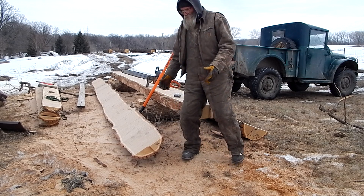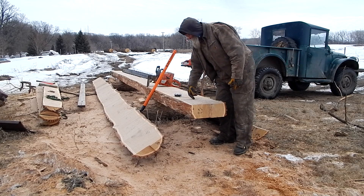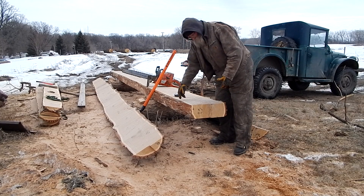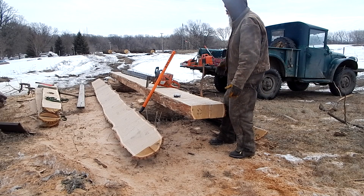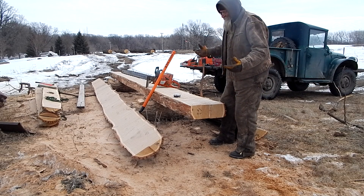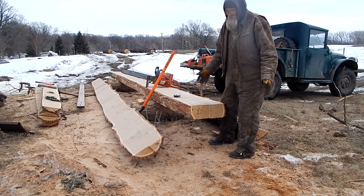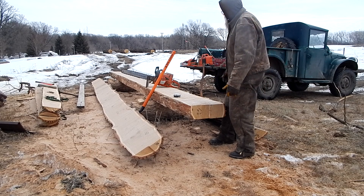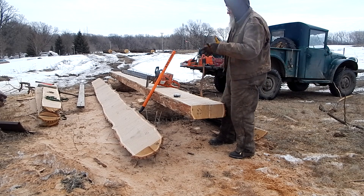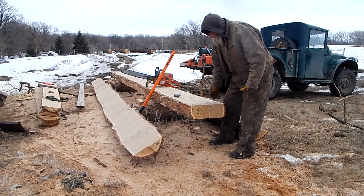So this is the design I want to use. It's an efficient use of your wood, because with saddle notch corners they've got to be longer with the log hanging out on the end. This is more labor intensive but it lasts longer. It's the design I wanted to build this time around — I've done the saddle notch thing before.